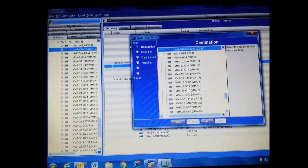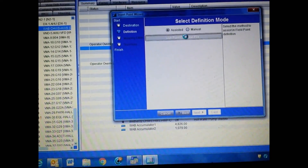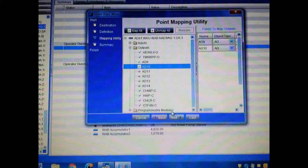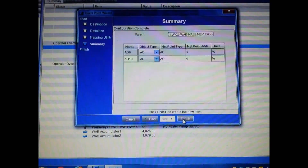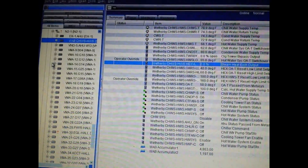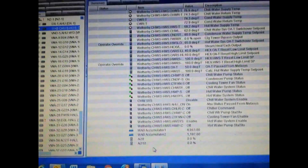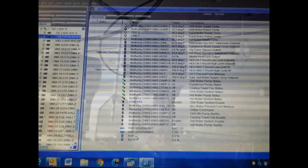After the programming is configured correctly and the jumpers are set, the next step is to pull those additional points into Metasys. For this DX I'm going to use the resource file that is in the DX, which allows me to go into the programming parameters, into the outputs, and simply select those from the drop-down list. Once I have those checked I hit Next, review the screen, and hit Finish — it goes out and grabs those two additional points from the DX program and pulls them into Metasys extended architecture. After a few minutes they populate, and here we are with the two additional outputs pulled into our system.